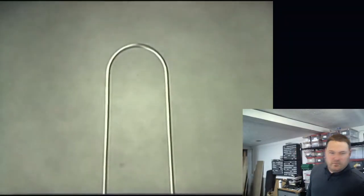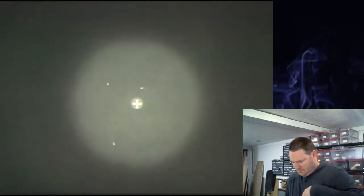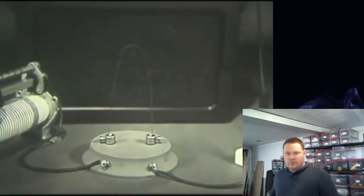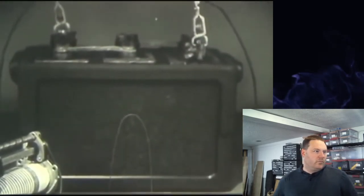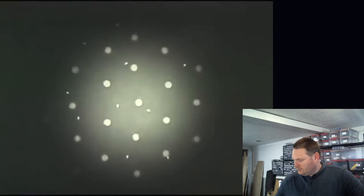This wire, like everything else, is composed of atoms. And if microscopes could magnify 10 million times instead of paltry thousands, one of these atoms probably would appear as a tiny elastic sphere, a sphere formed by negatively charged electrons swarming around a massive nucleus of positive electricity. Some substances, especially metals, do not keep their electrons tightly bound to the individual atoms, but allow them to roam around aimlessly between the atoms in the interior of the substance. Such substances are called electrical conductors, because if a battery is connected to the ends of a wire made of such a substance, the free electrons drift along the wire, continuing their aimless motions as they drift. It is this mass movement of electrons that we call an electric current.